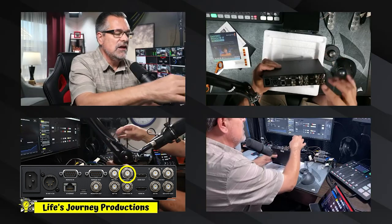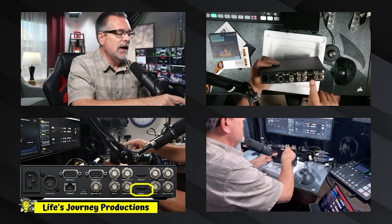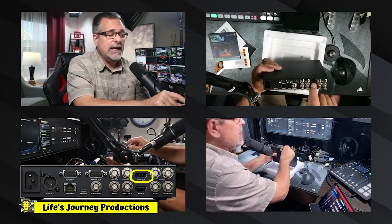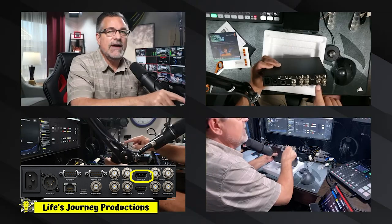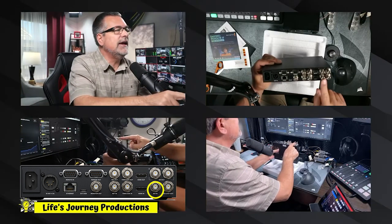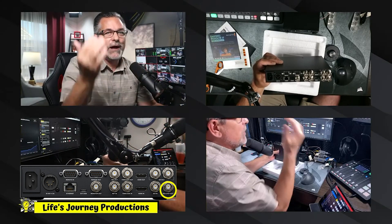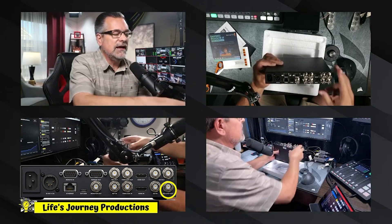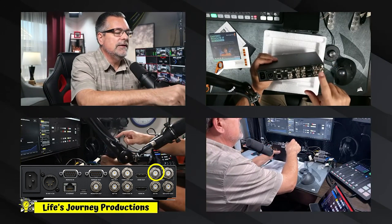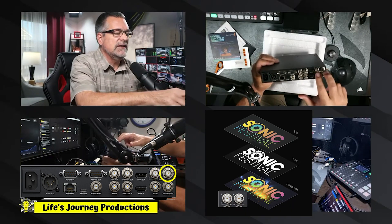And that's the big change — HDMI in is a big change, right here. Then you have HDMI out, which is normal; the HyperDeck Mini had an HDMI out. Then you have SDI in, so I could come right out of a Blackmagic Design camera and go SDI in. I have SDI loop out, so I could come in and go right back out again if you wanted to loop a bunch of decks. And then you have your fill and key — your two channels.